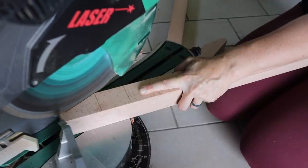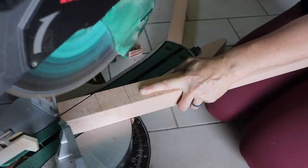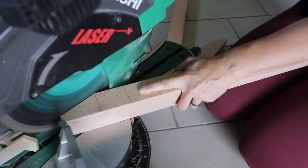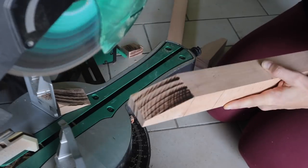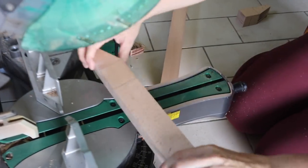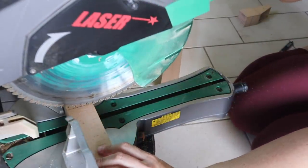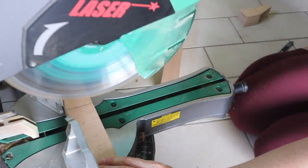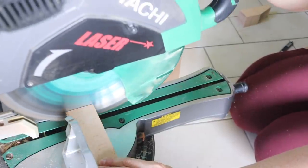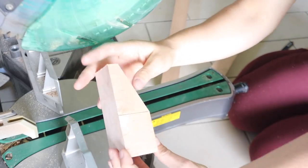So when you leave that angle at the bottom like that and you make it underneath that second line where that 1x3 was measured, everything will be flush and square. Once I am done with that, I'm going to set my miter saw back at 0 degrees and I'm going to cut the length off. I like this way a little bit better, especially for beginners, because if you're not experienced with saws, it's just safer. So do it this way.